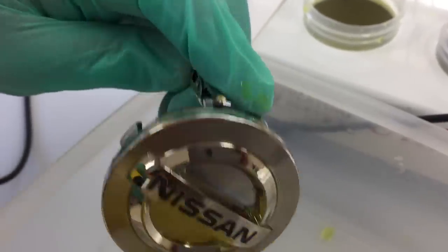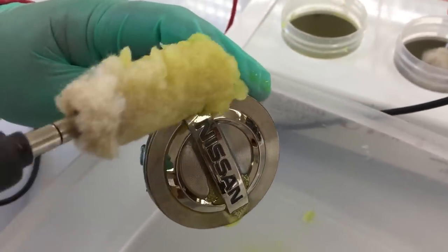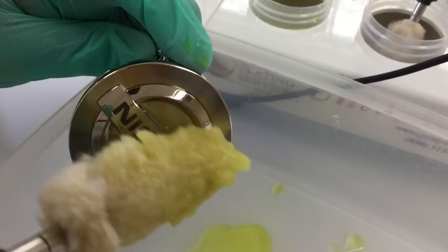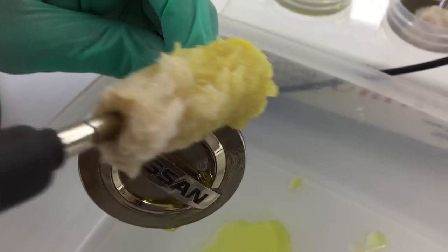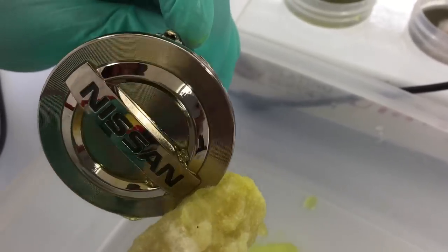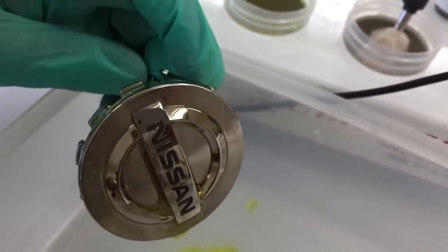I clipped the black clip to the back here, just anywhere off. And I'm only going to be plating the part that's going to be visible, because this will be mounted onto a car. You don't want to worry about the part that you can't see. So I'm just taking my time and chrome stripping everywhere that's going to be visible, all the way around the edges here, down in these little nooks and crannies.